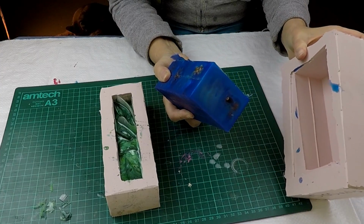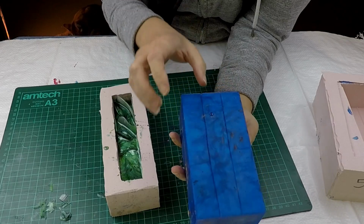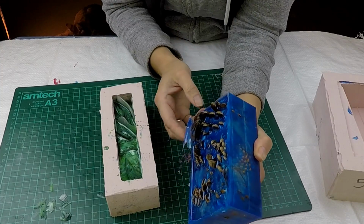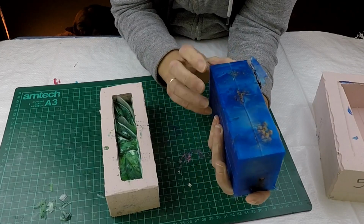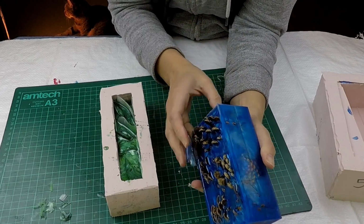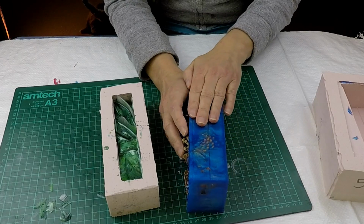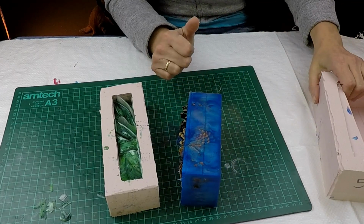Perfect, the mould survived pretty well. So I've got the grooves on the back there, and the groove at the side for cutting it. It's slightly wider there, or slightly narrower, down to 20 mils there. So that makes it easy putting it straight onto the bandsaw. It bulged out slightly here. I noticed it hasn't on this side, which is fine for the cutting.